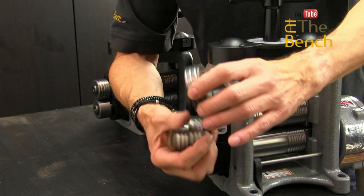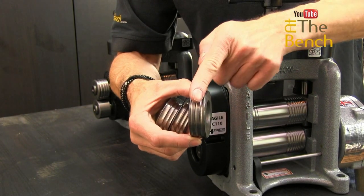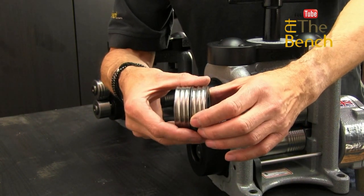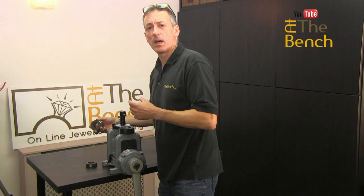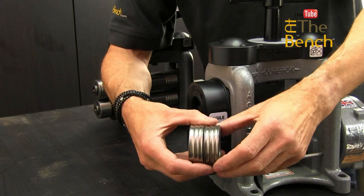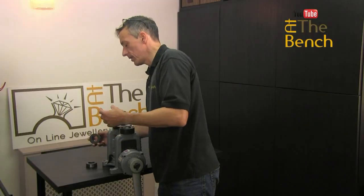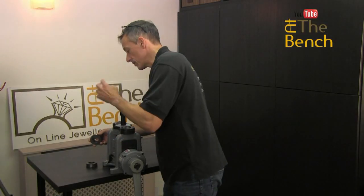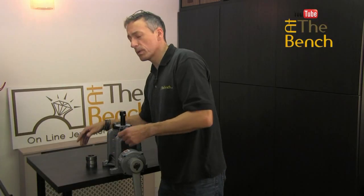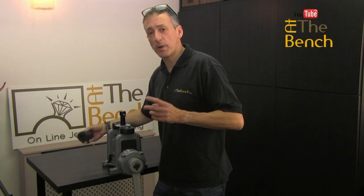There's the one that came with the machine — just three little D-section grooves, simple scoops out of the rolls that go all the way around. Then I've got two others that are a bit more of a wider D-section and also just that little bit deeper, which will allow me to make D-section wire of various widths and depths. And I've got another one downstairs with literally just two grooves — about six and eight millimeters in width — for when we want to produce really wide D-section wedding bands and bangles.